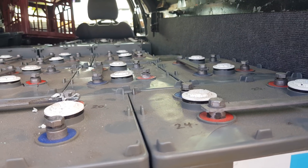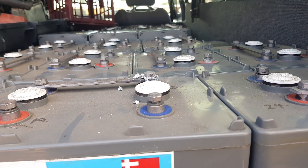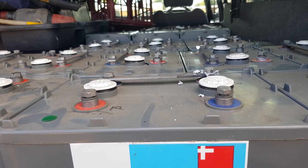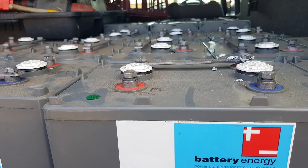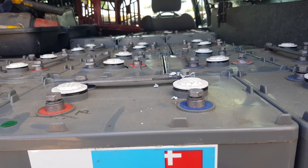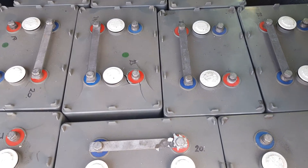So that's 240 amp hours times 24, which is around 23 kilowatt hours if you could totally deplete them. In the real world, about 20 kilowatt hours — and that's a 20 kilowatt hour battery for about 500 bucks. Once these are in service, I'll make a video about putting them in service and showing you how to link them. Sadly, they are going into a 12-volt system — I don't have a 24-volt or 48-volt inverter, so we're stuck with that.